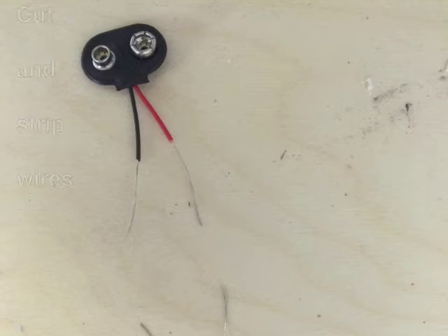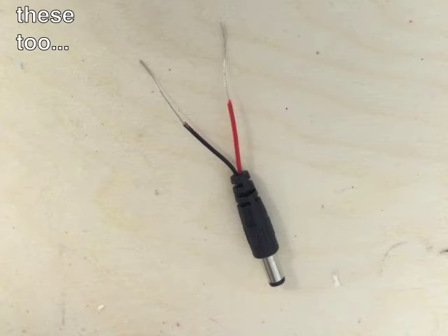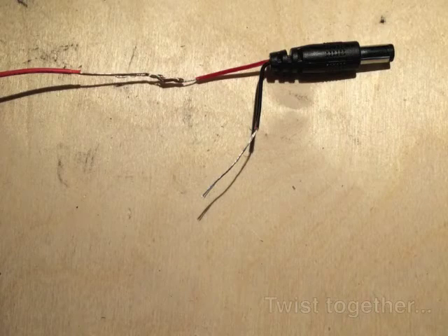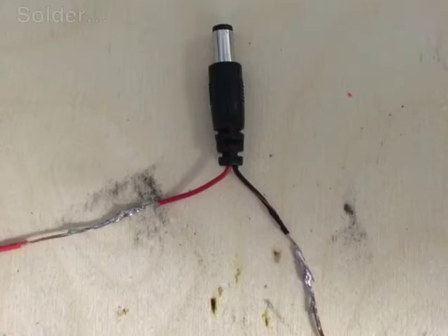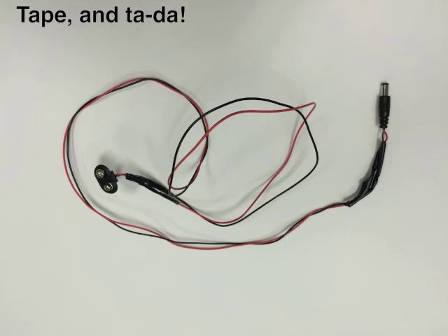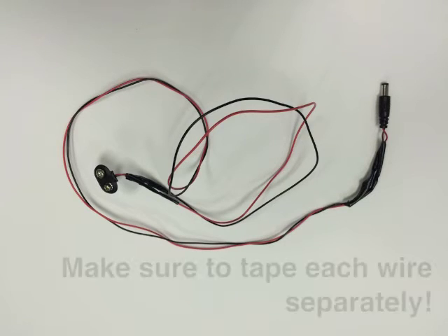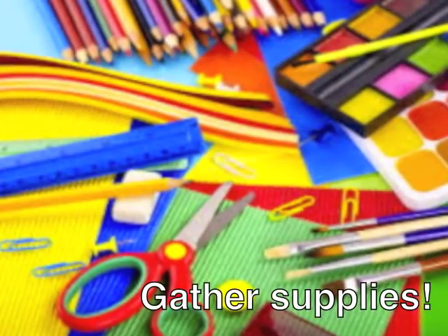To implement my design, I knew I needed a longer power cord to connect the battery pack and the Pi at opposite ends of the selfie stick. So I opened up my current power cord, stripped each of the four exposed ends, and soldered in two pieces of long wire — one positive, one negative. I covered the exposed parts with electrical tape and had an extended cable.